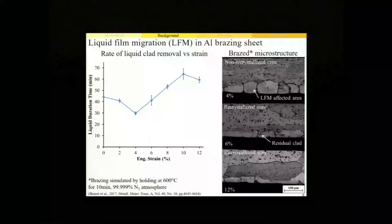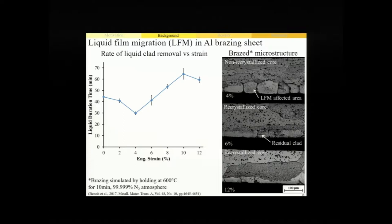But all these past studies only looked at the forming temperature and have not given any consideration to how this change in forming might impact subsequent brazing and corrosion performance. This might be a critical gap in our materials processing knowledge, because it's known that during brazing detrimental interactions between the liquid clad and the solid core can occur. One of these interactions, which is particularly important for strained brazing sheet, is the phenomenon of liquid film migration, where during brazing the liquid clad alloy can penetrate the solid core along the grain boundaries, forming a liquid film at the boundary which is then able to migrate. As this film migrates, it dissolves the core alloy and second phase particles, impairing the mechanical integrity of the sheet, and re-precipitates an aluminum-silicon solid solution behind the film, depleting the amount of liquid clad available to form braze joints.